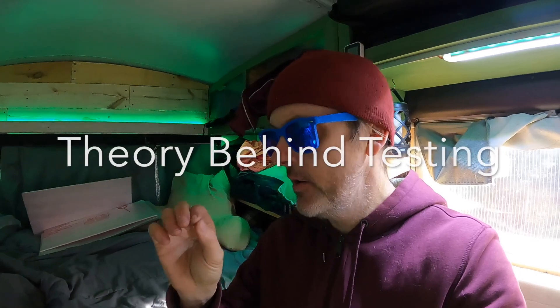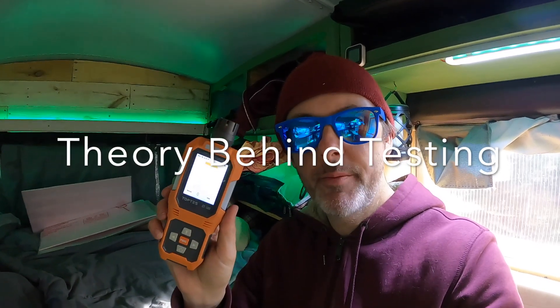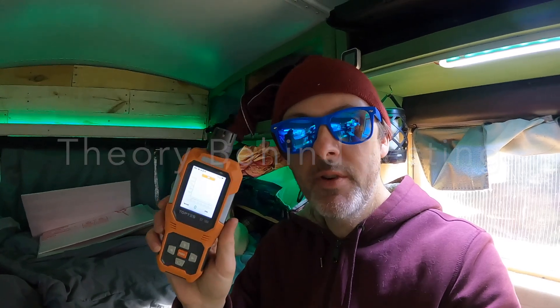The theory I'm operating on for testing is we're basically going to go outside, hold this carbon monoxide sniffer next to the exhaust, run the heater in the lowest setting, gradually run it into the middle setting, and then gradually into the high setting. If the settings are correct, the lowest and highest settings are going to be running the dirtiest. The most efficient way to run your heater is somewhere in the middle — the most efficient also means the least soot generated, which means a much longer time between the thing coking up and not working anymore.